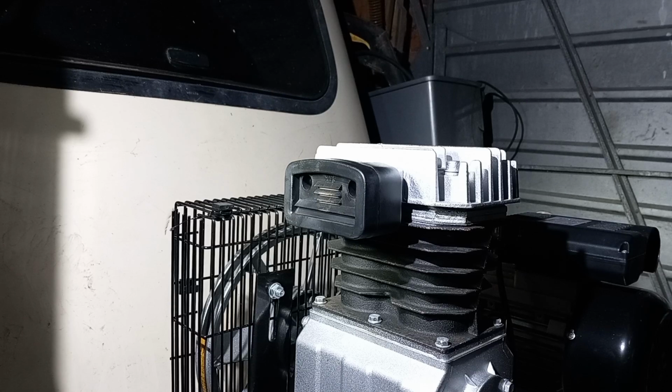Draining the water out of the tank. And I'm going to be honest, that is the one that I focused on mainly with the little compressor. Nothing else killed the compressor or anything. But if you leave that water build up in there, you can have a right nightmare. You only have to look on YouTube to see what happens to them tanks when they go. They blow up. So it's well worth emptying the water.